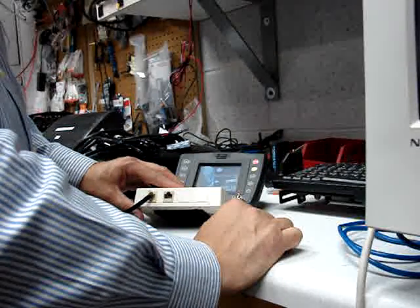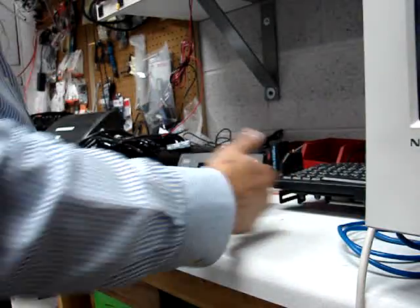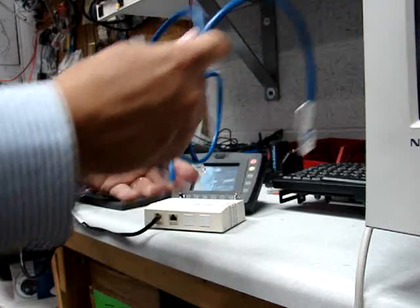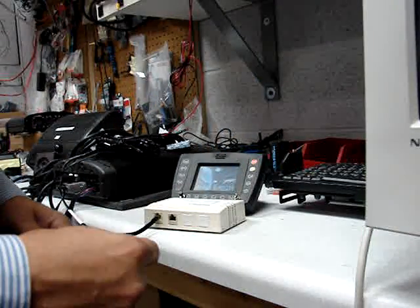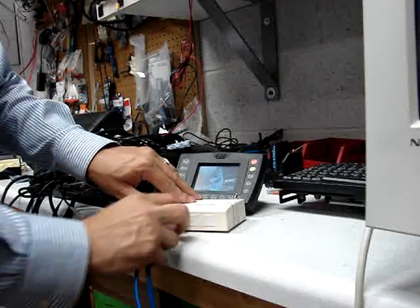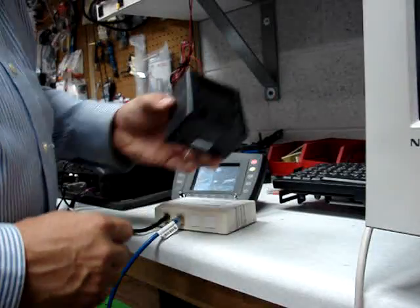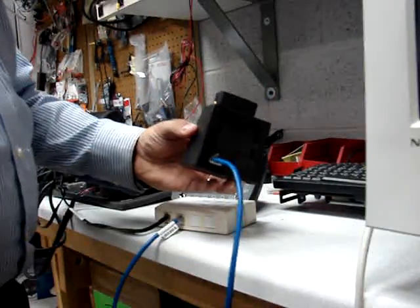The recording will start on the digital patroller unit from the triggering. Take a CAT5 cable that we're going to supply you with, or that you can add yourself from your IT department. You're going to plug one end into our adapter, then take the SilentPartner wireless microphone and plug it into the back of the unit.